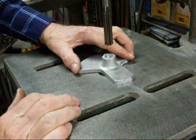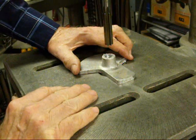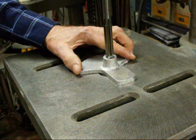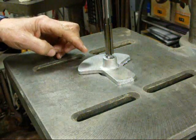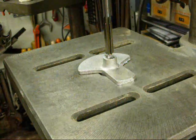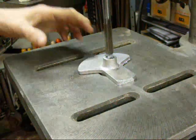Now I know what some of you are saying — that crazy fool, why doesn't he have that in a drill press vise? Well, in something this size, the reason is that I want the work to literally float around and pull itself onto center into the reamer so that I'm not getting a bell-mouthed hole. This is the half-inch reamer and we've already got some cutting fluid on there. And one thing I never did tell you — never run a reamer backwards. In a hand reamer or in any kind of machine, you will dull it very quickly. It's only coming clockwise.